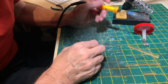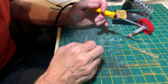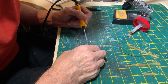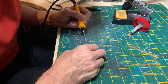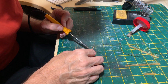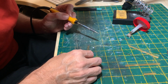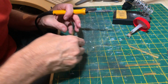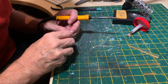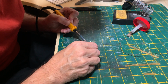It's then a case of going through and completing the solder. Now you're seeing me work on the other side, and you'll see me also starting to form the shape of the cage as I'm putting the bits of solder on. And as I said, you're not putting the heat there very long, so you don't burn your fingers doing this. There's not much heat transfer along the brass. And again here I'm just forming the cage to give it a better shape, because the 6.3 is a little bit too big.